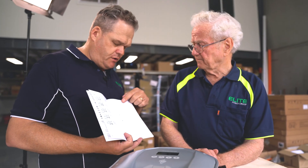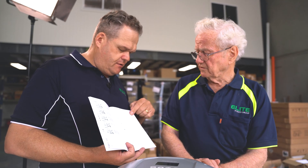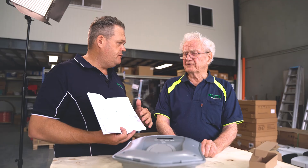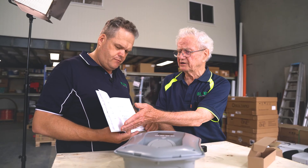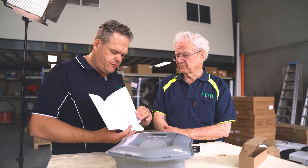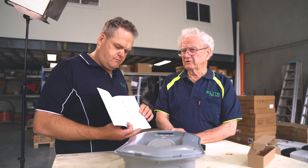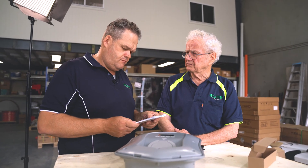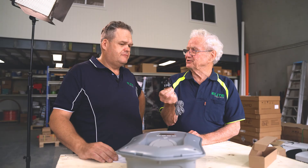These are all the different modes you can go through - the three modes: fast mode where no matter what's happening you want to put charge into your car, eco, or eco plus. Eco plus will only work if you're producing solar. If it goes from sunny to cloudy it'll just throttle down. If the solar drops below a certain threshold it switches to a waiting mode - waiting for solar. There's a minimum threshold where it says there's not enough, I'm not going to put two watts into the car, I'll just wait until it comes back to a reasonable value and then start again.